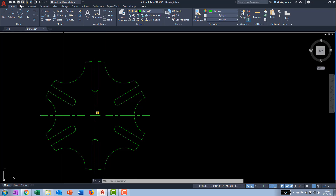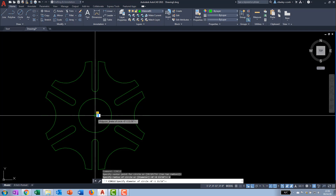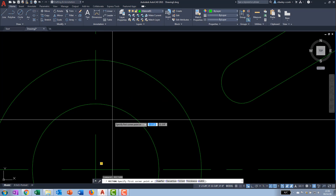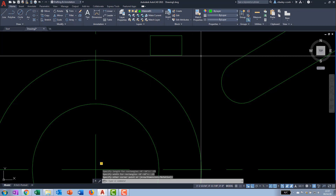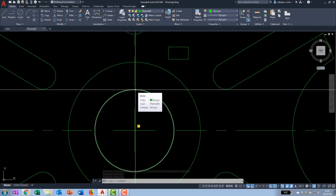Now get rid of the guide circle. Next, do the keyway itself. Draw a circle of diameter 1.67 from the center, and another circle for the hub with a diameter of one inch. Now for the key way, draw a rectangle — there are a couple of ways to do this. Draw it 0.25 wide and 0.15 tall. Type D for dimensions, enter 0.25 for width and 0.15 for height, and click to place it.